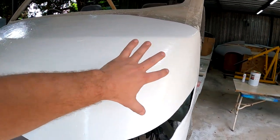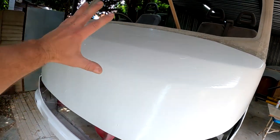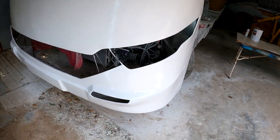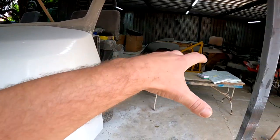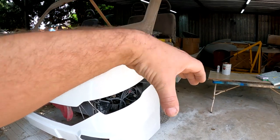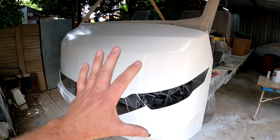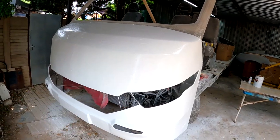So what I'm going to do is start reinforcing this mold with the fiberglass, at least the top areas where gravity won't be against me. I'll not necessarily go around the corners yet and go underneath yet. And as soon as I've got a couple of layers on top of that, I'm going to remove it and put it there on the ground, and I'll be able to then do the rest of the fiberglass work with this nose standing on end like this. So it is probably a little bit unconventional, but I'm going to try and do it that way so that I at least know that this plug won't crack and break and fail on me before I finish making this mold. So let me start with that layer and then work from there, and we'll see how it goes.